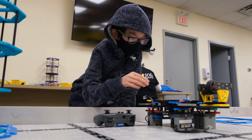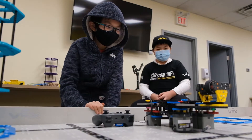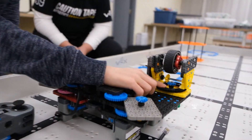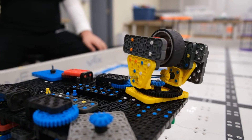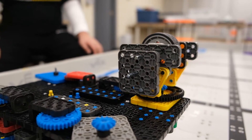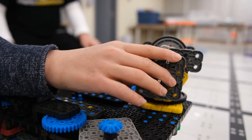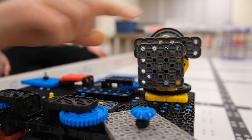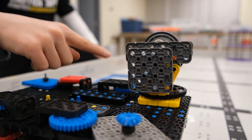I just finished my swerve module. As demonstrated over here, we have a blue gear that spins our custom part, the ring gear. What happened in our prototype is that the ring gear goes up and above the gear, so it slips. We're going to think to put a plate here so that it doesn't go up.